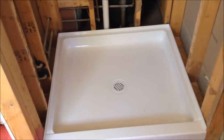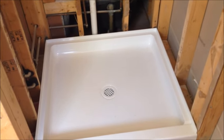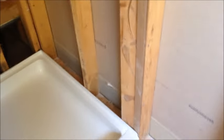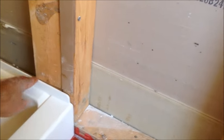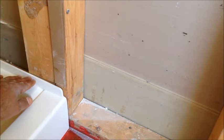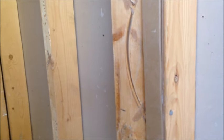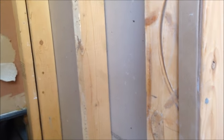I'm going to cover the surface and start working on putting up the green board on the outside. Green board is what was in here originally and it held up really well, so I'm going back with green board rather than cement board. The instructions say they wanted a half inch between the flange and where the board is, because of wicking effect — you don't want water wicking up onto the green board. I also had to get some spacers to make sure the walls are nice and flat and all the studs are lined up.